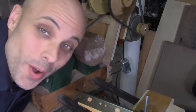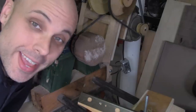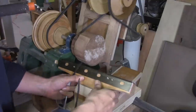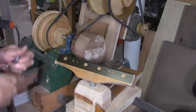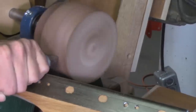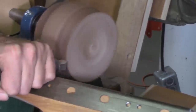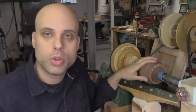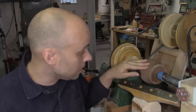It is seriously all led up to this. I've spent the last six weeks working on this lathe, and now it's ready to go — here's the maiden voyage. I bring my tool rest over, adjust it just a tiny bit higher, and let's turn. So, it works. I even got a very good finish on the wood. It hasn't been sanded or scraped or anything, and the grain is clear and it's even got a bit of a shine, which means I don't have too much vibration and things are turning steadily and concentrically. That's great — got to call that a win.